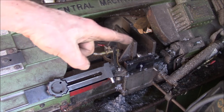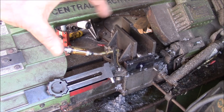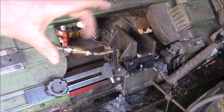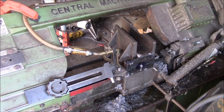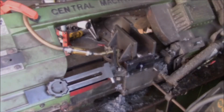Maybe I fixed the vibration problem because I couldn't figure out what was causing it. I'm using a variable pitch blade, which is supposed to be anti-vibration — it's 10 to 14 teeth per inch randomly distributed across the blade so you don't get any standing frequencies from the saw teeth. So far it's looking like it's working well. If you have any questions, post up in the comment section below, and as always thanks for watching.